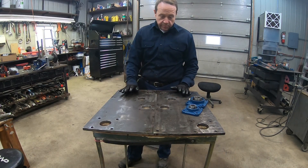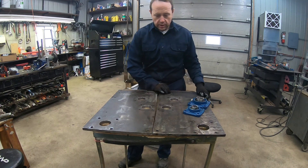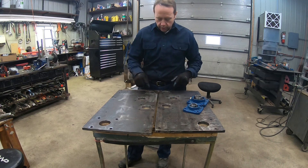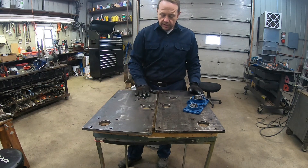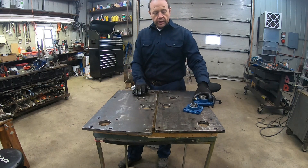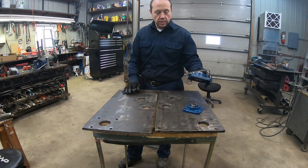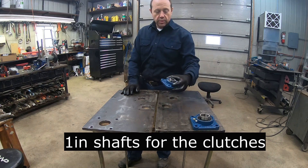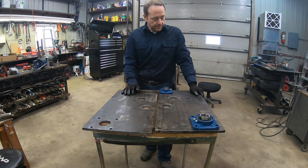Mike and myself made those plates. It's a half inch thick steel plate — they are duplicates, welded together so that we get exactly the same placement for the holes. I have those two, and actually another one — bearings that go for the big sprocket, and the small one here and here, for the small one-inch shaft. I'll show you later what it looks like.